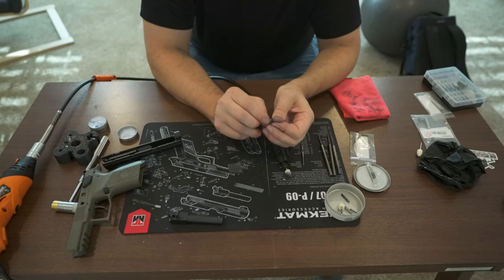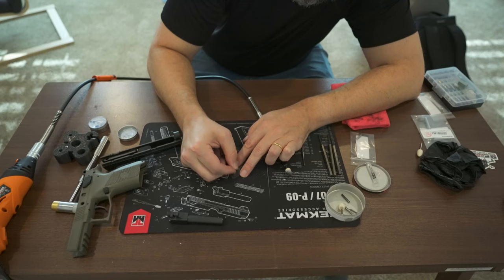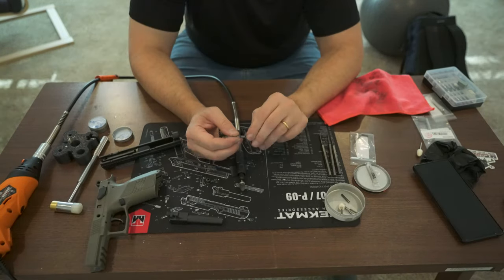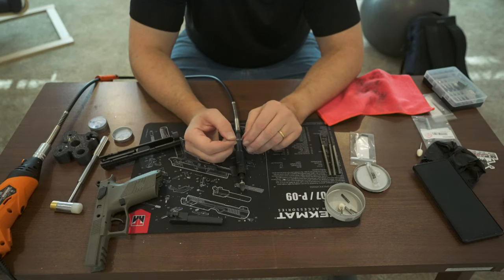All you do is slide your fingernail across it, and if your fingernail stops, that's where you need to focus. This is part of the drop safety of the gun, so it is a critical component. That is awesome — that is like butter. Nice, smooth, clean engagement.